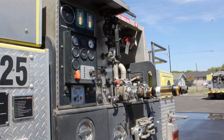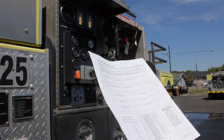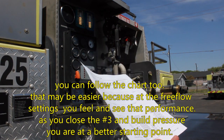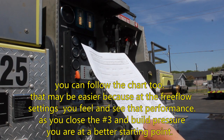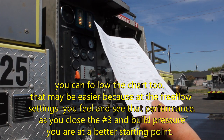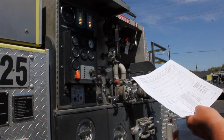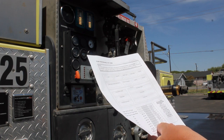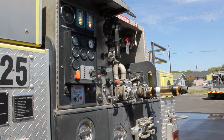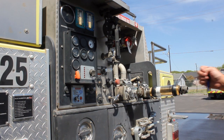And that's the process. So to recap, without the motor running, with a little bit less noise, I start at the bottom of my chart because I crank it up as high as I can get my pressure to go, and I get my max pressure at 0 gallons per minute. That's shut-off pressure, and we got 405. Then we took a measurement at 400, and we couldn't really get anything at 400 because that's about our max shut-off pressure. So our first measurement was at 350. We got 20 gallons a minute, and you get your RPM up there, and that first one, it's kind of where you find your first sweet spot.